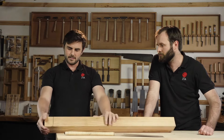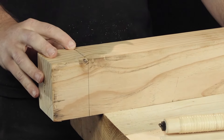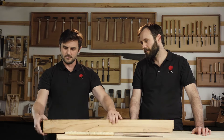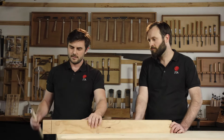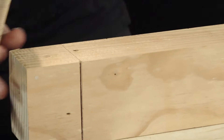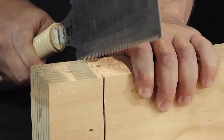So that's half the cut done — we've gone about halfway into the piece. As you can see, we've kept that edge exactly where we want it, we've protected the line. We'll continue that the rest of the way around the piece. It's the same thing — let's go from the opposite side. We've already got a little establishing cut there from the previous cut, and we'll do the same thing on this corner, using my thumb again as a guide, lining up the saw, and then small cuts to begin with.